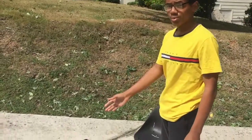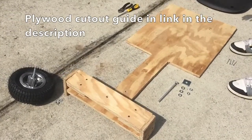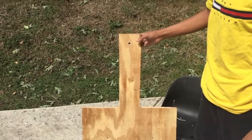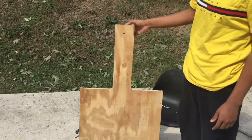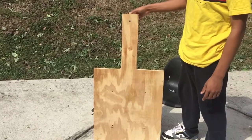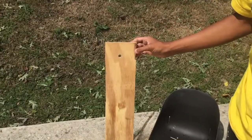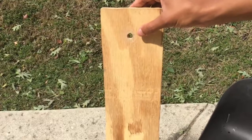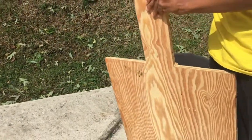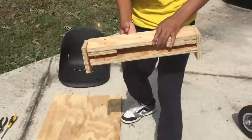You're gonna have these two plywood pieces right here, and if you follow the plywood cutout guide correctly, this first piece is the top part of the frame. There's gonna be one hole in it — a three-eighths inch hole — and you drill it by measuring two inches down from the top and two inches from the side. Where those measurements connect, draw a circle and drill there.